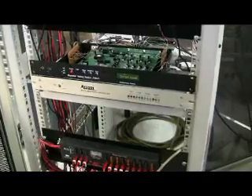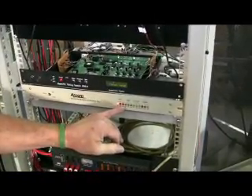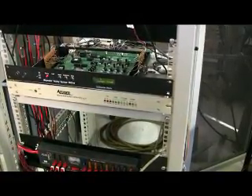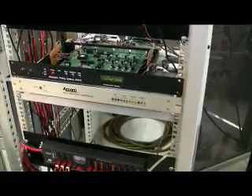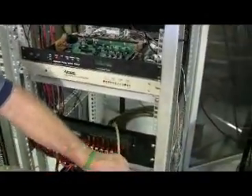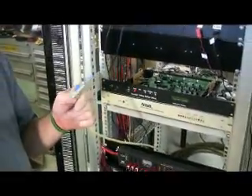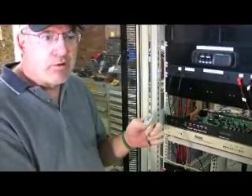It has three ports which allows you to have three transmitters, three receivers, and also has an auto patch function and other audio inputs. What's unique about this ARCOM controller is the availability of an RS-232 connection which can hook right to our computer for programming.